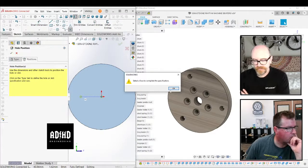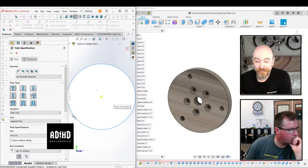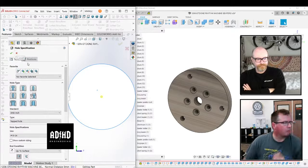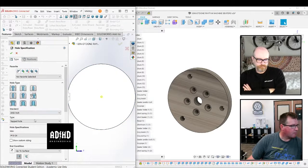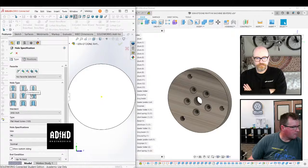Can you clarify? I was watching Tim do what he's doing, and I kind of wasn't listening. I apologize. So when you import an IGS into SolidWorks, it imports it as one multi-body part. For example, this drum assembly has 56 bodies. What you can do is separately right-click each body and insert it into a new part. It takes that body and inserts it into a separate part file. You can save that part file to the right PBS code, and you can re-engineer that part like what we have seen before.